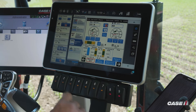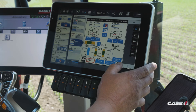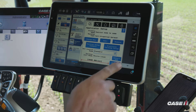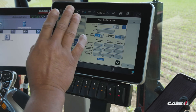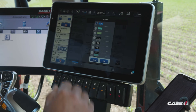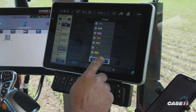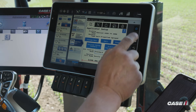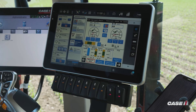If you don't have your display set up this way, the alternate path would be to hit the gears. Once I hit the gears, I'm in my setup page. I hit tip select and it takes me to that same menu — again, color-coordinated tips to match the color of the tip you're spraying with. Once I select that, I go to my home page and I'm ready to begin spraying.